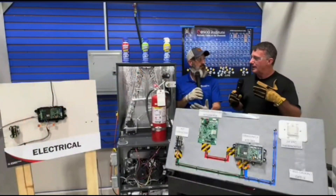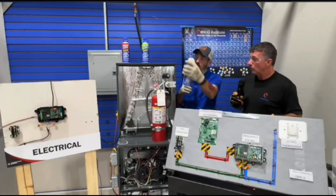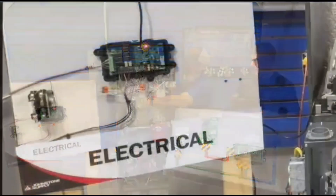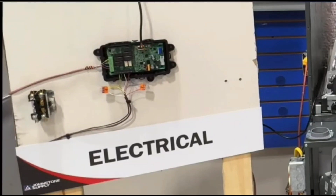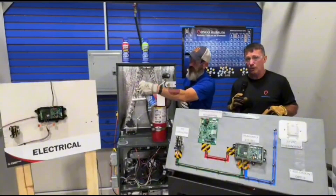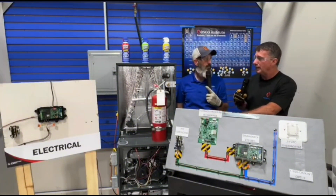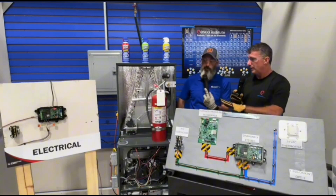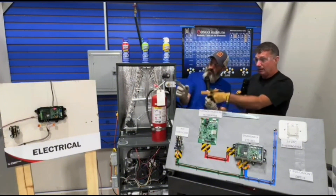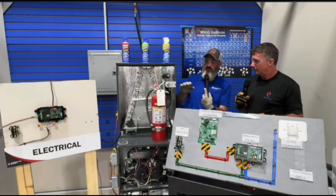So let's give it a try, see how fast this responds and see what our actions are. Okay, so we're going to introduce some R1234YF in vapor form into the cavity, and already our RDS sensor has detected the refrigerant — you can see the flashes — so it's going into mitigation mode. Within 30 seconds it should shut off the outdoor unit, shut off the gas furnace if it was running, and turn on the blower. We've dissipated the gases from the small leak and we're no longer recognizing refrigerant.